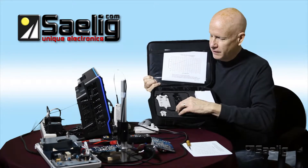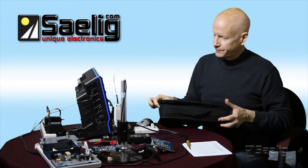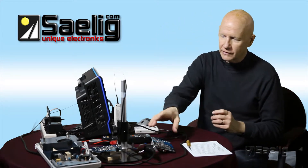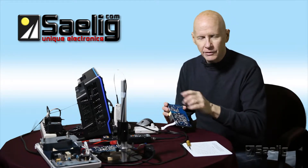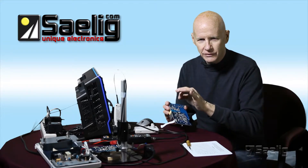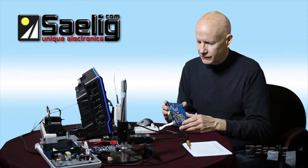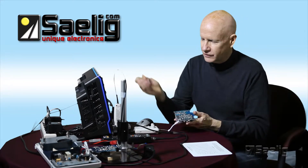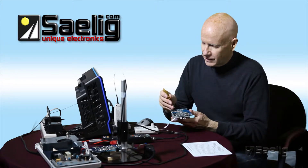What I'd like to do is just mention how to set it up — it's actually quite easy. If you have a trace that you want to measure current through on a circuit board, often the problem comes up that you have to cut the trace and put a loop of wire between the two cut ends, and then you can stick one of the smaller precision current probes on it. The purpose of the iProber 520 is so that you don't have to cut the trace. What you're doing is taking the little chisel or screwdriver endpoint of the iProber